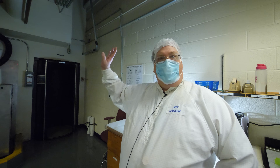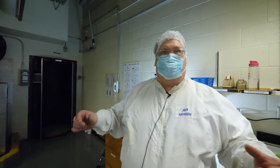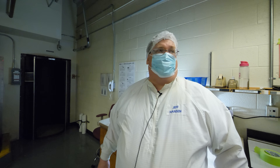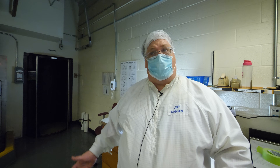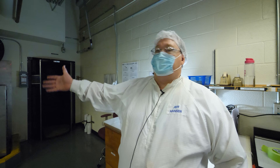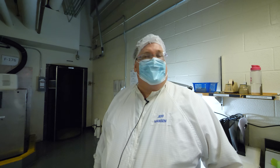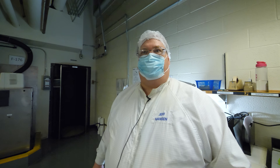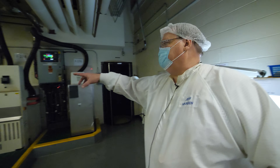Through the rolly door, all kinds of testing happen — they'll cut it into 35mm strips, look at large areas for general physical quality, and then the film strips are loaded into the front end of the photo processing; this is the back end. C41, ECN, black and white, industrial, Ektachrome — they're all here. Some of the processors are dedicated and some are shared — these are mini labs.